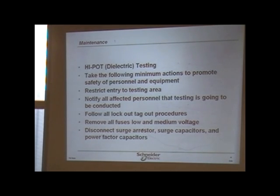Yeah, you open everything in the panel and then bring your main back up. If it'll stay on, right, to find it, exactly. And then bring them up one at a time. Exactly, exactly. And that's the right way.